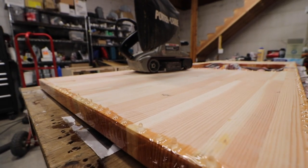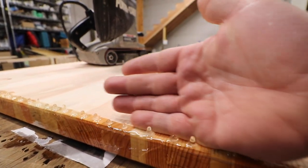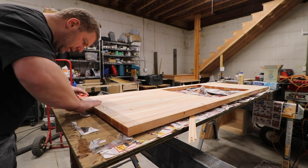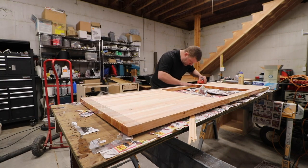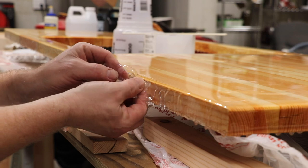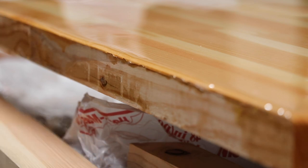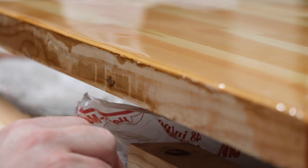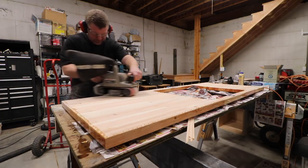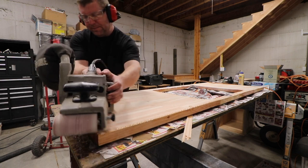You're going to have drips that stick to the edges if you allow the epoxy to flow over the ends and the edges. To make getting a super clean edge easy with no sanding at all, use packing tape — the clear shiny stuff, not masking tape. The epoxy won't stick to it and it'll literally just break off as you peel the tape, leaving a super clean edge. Do this everywhere you don't want little drips of epoxy: inside, outside, on the ends, the back, wherever you want to keep the epoxy away. Use several pieces — it's cheap and it's easy. It'll make your life way easier when you're done. Our first few coats we didn't do this and we had to sand the bumps off, which is super annoying and messy. Tape on the second time worked a charm.